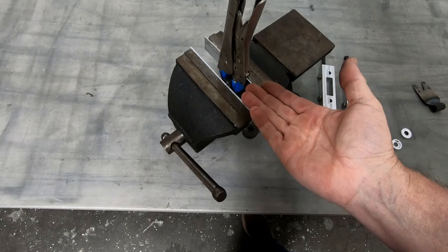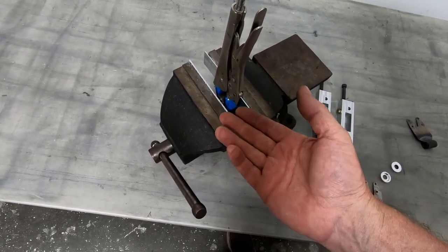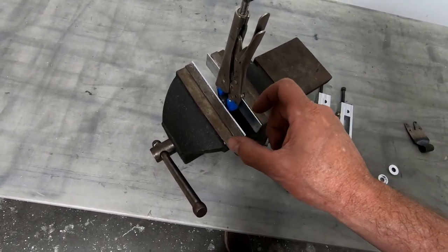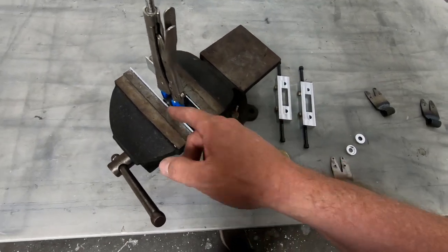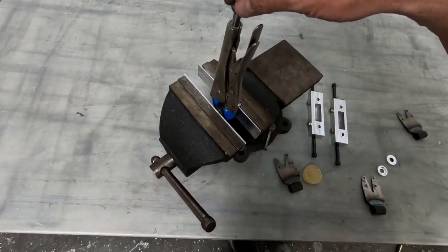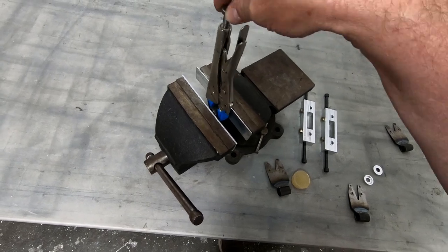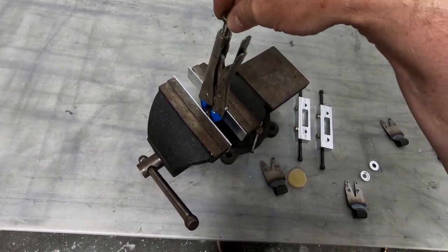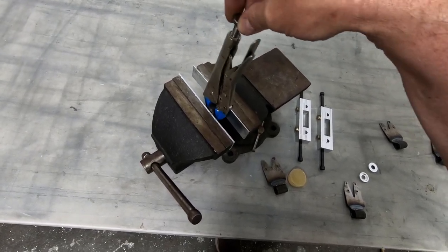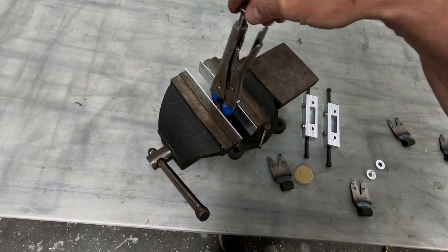But if the force is upward across the entire bushing, even at 100 pounds, which is what each one of these is carrying, I don't think that inner bushing is going to move much up and down compared to the outer bushing, which is a good thing. We don't have a lot of gap in there anyway that's even filled with that rubber material. But as I mentioned before, this is the purpose of these bushings. Upon landing, it's supposed to provide a solid connection between the landing gear and the brackets and allow it to flex like this. And actually right now this poly material is working perfectly.